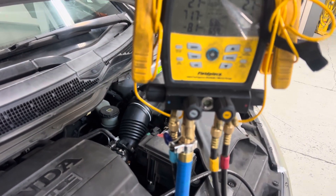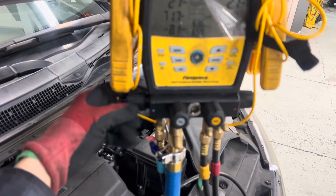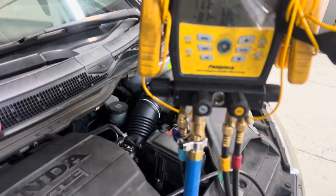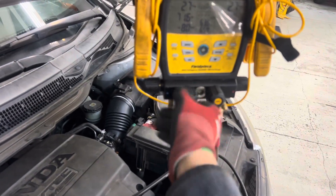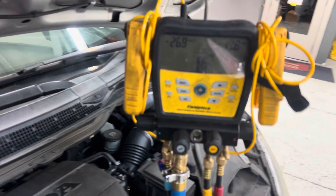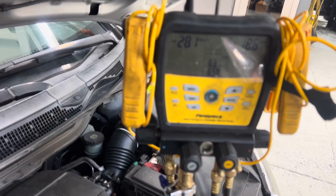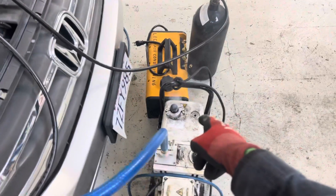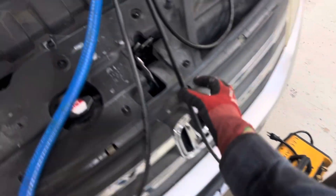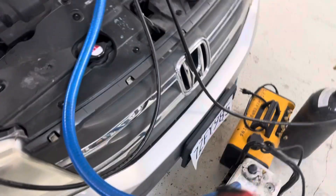So now the low side is closed, high side is closed, low side is open — and let's open it again. What I will do is hook up the second vacuum pump, even though it is only a small quarter-inch going through a line that's really restrictive. We'll have two pumps running anyway on the third time that I do this.